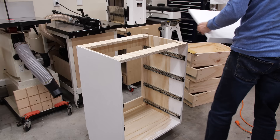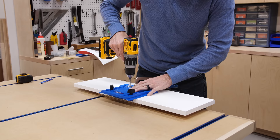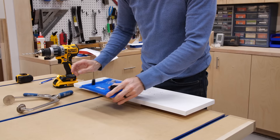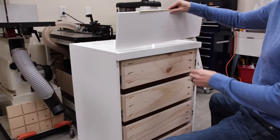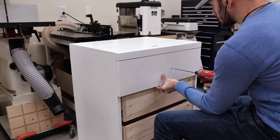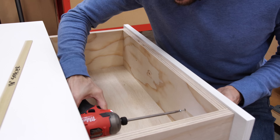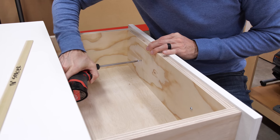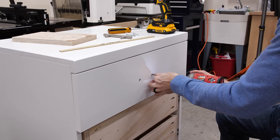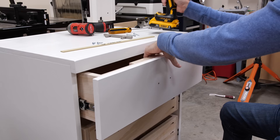Next I switched back to finishing up the cabinet. The top gets attached from underneath and then I could mount the drawer fronts. I drilled holes for the hardware, which also let me easily space and mount the fronts. I started from the top since the trim is flush there, used an eighth-of-an-inch spacer on the top of the drawer front, and screwed that front to the drawer box temporarily with pocket screws. With it held in place I could open the drawer without the front moving and permanently secure it from the inside through those pre-drilled holes. To finish it off I removed the front screws, drilled all the way through the drawer box, and installed the drawer pulls — this is my favorite method of installing drawer fronts and lets you hone in on perfect reveals without a lot of fuss.